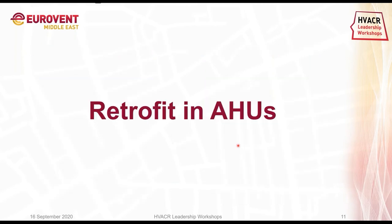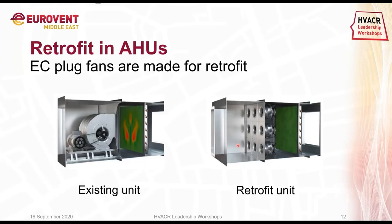Taking the EC technology into the retrofit business, and of course we heard it already multiple times today, we can also use EC fans for that. I made a quick comparison of how it looks. On the left-hand side, we see the existing unit where we have the belt-driven fan with the blower. You see that the air power will be on the red spot, and the blower basically fits a quite small part of the filter. We can change it into a fan grid, where we can use multiple fans, and then you see that the air gets better distributed than with the original fan.